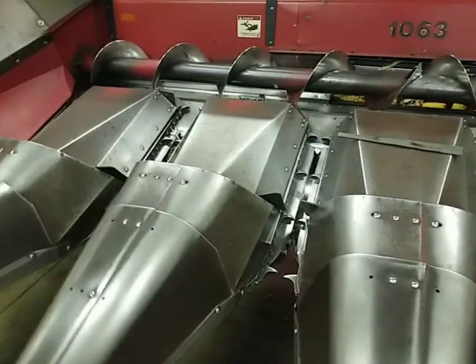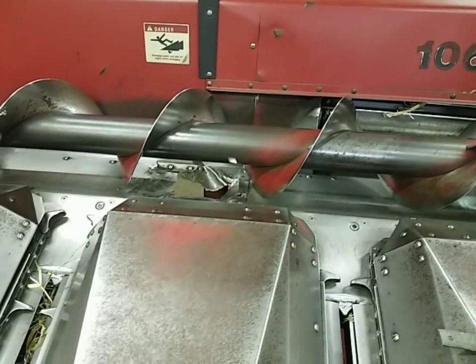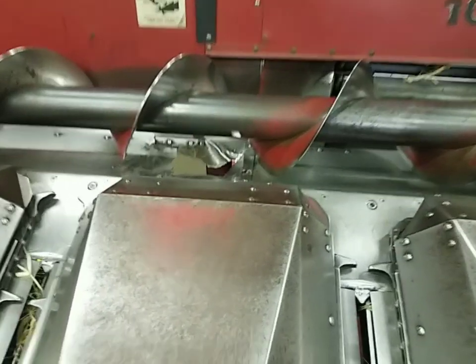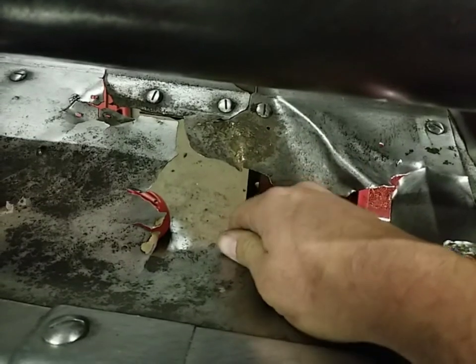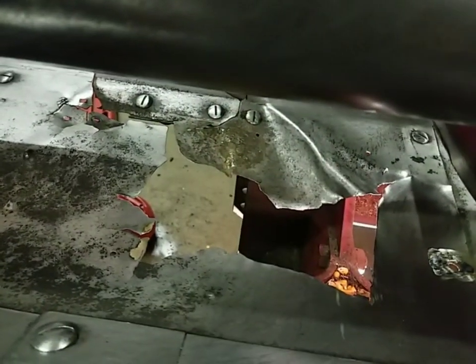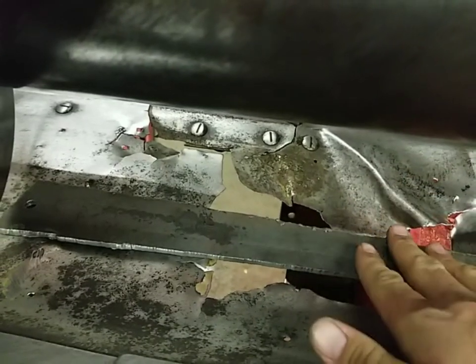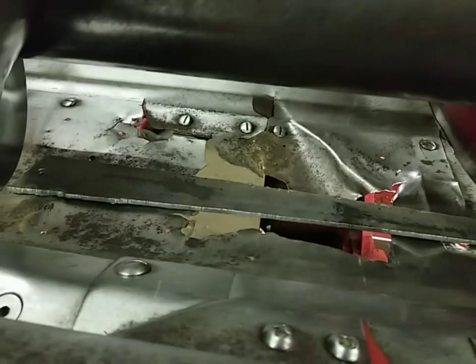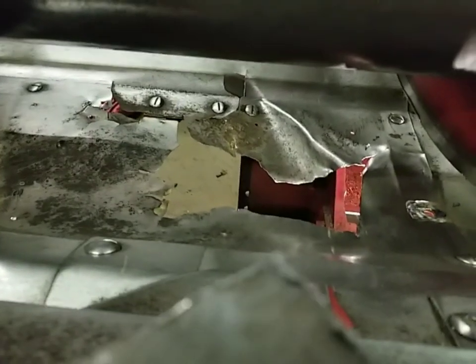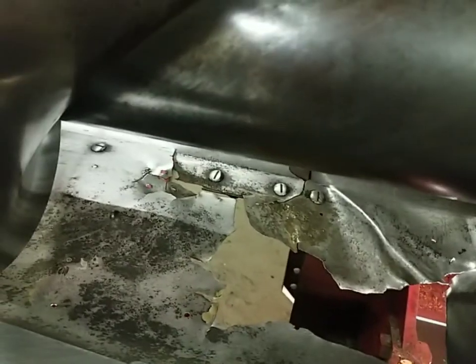What we have to do first is — they don't want any hole larger than three inches — so we need to bridge this hole somehow to support that poly plastic over it. We don't have to get too crazy, we just need to bridge it. We're going to bolt this flat steel underneath the old auger trough, and that'll be enough to bridge that hole for the new poly to lay on. Dad already made this piece out of scrap we have laying around.